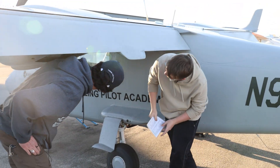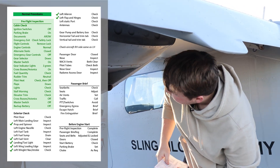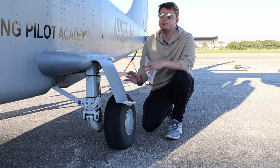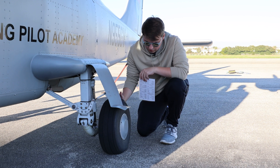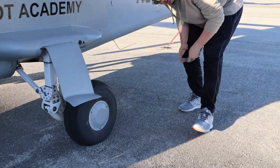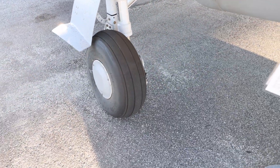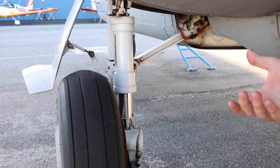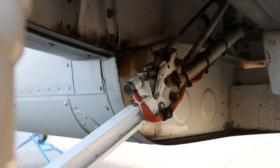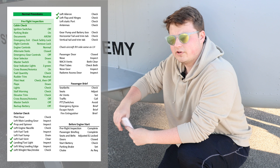While we're under the engine, before moving on to the actual fuselage, we're going to look up into the engine around our exhaust manifold and look for coolant. Our coolant bottle is hidden up there — we just want to visually check that we can see some reserve coolant. Now we're going to check the condition of the landing gear. Starting with the tire itself — making sure there's no balding, no in-depth scratches, and it has some good air pressure, which you can check visually. From there, we'll check the brake caliper — making sure it's in good condition, no hydraulic fluid leaking, and the brake discs look good. Check the strut to make sure there's good pressure in there. And finally the most annoying one — you have to dip your head all the way up and look for a little micro sensor inside. That little switch indicates whether the gear is completely down — if it's not connected, we'll get incorrect indications inside the plane.